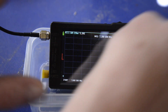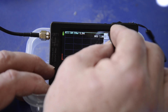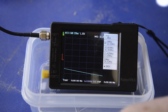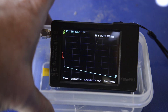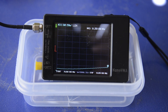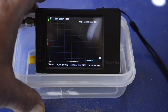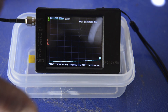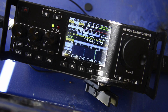All right, so it's on 40 meters by default when I turn it on, so we'll go to recall, hit 20, and there you go — looks very good, especially for the top end of the band. But I'd like to make a CW contact, so I'm going to extend the whip a little more. That is much better — that is prime for what we're trying to do here, to make a quick 20-meter contact. So I'm going to pull up my Parks on the Air page on my phone and see what's hopping.